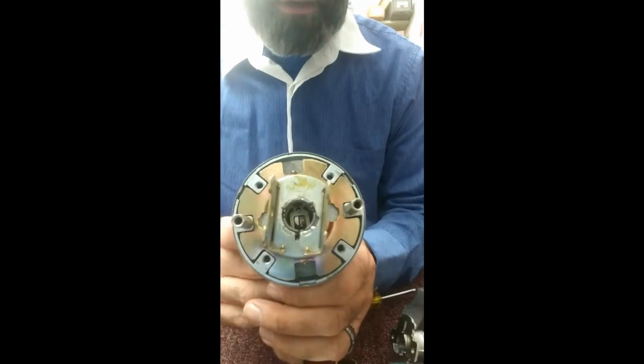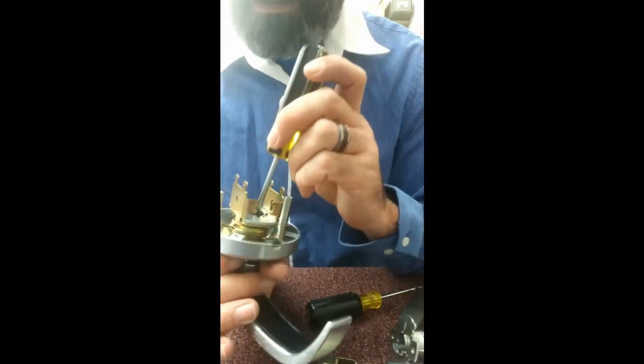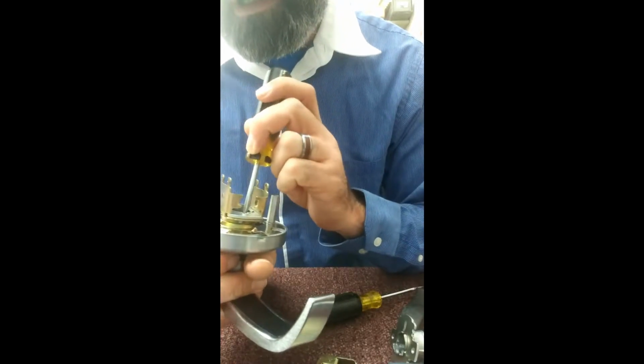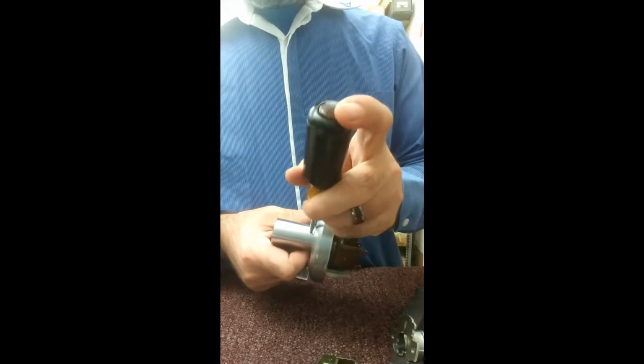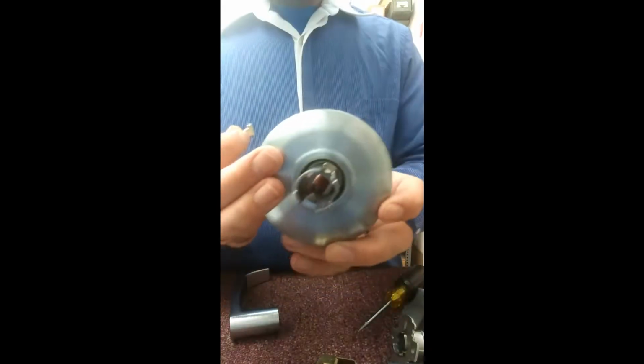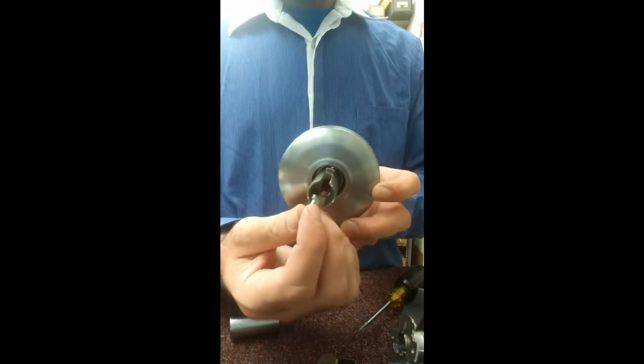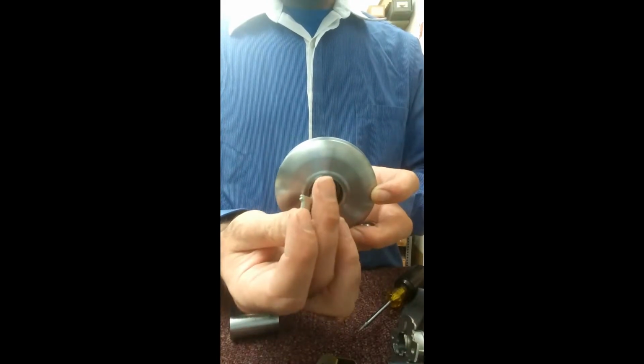Okay, so, better thought, easiest way to go about this. Take a flathead screwdriver, try and get between the tail piece and the shaft, and kind of try and knock that tail piece loose. Once you do that, then you should be able to depress the ring and pull the lever off, just like that. A lot of the trick with getting this outside lever off has to do with trying to get this out of the way. Because what you don't see is down on the inside of there, it's kind of like a C-shaped piece. This piece, when in the vertical position, prevents it from being depressed, but when you turn your key and go horizontal with it, it allows the pin to be depressed and pushed down. So, voila, cylinder.